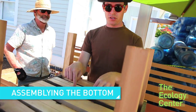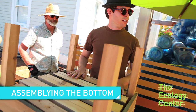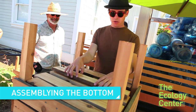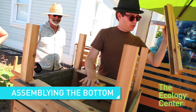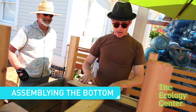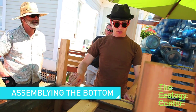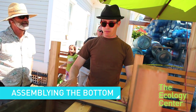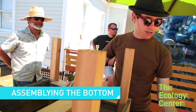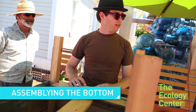I do recommend doing two screws on each bottom plank so we have some integrity to it. The most complicated part is fixing this joist in place. You can see mine's not perfectly straight and the bottom is starting to curve up a little bit, which isn't the end of the world — but if it were much more than that, we might want to redo it. We'll want to make sure it's flat, and using a block like this against the side will help find that levelness.